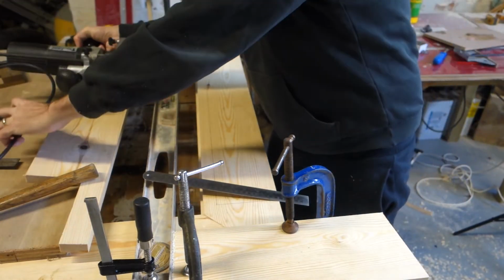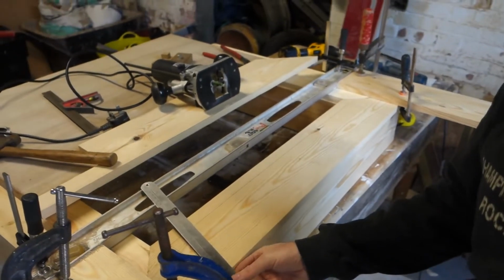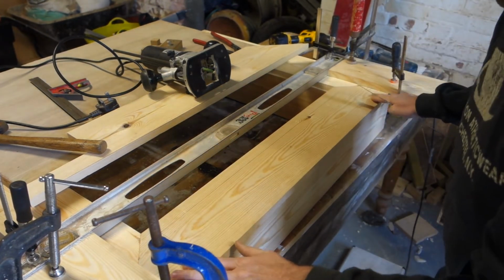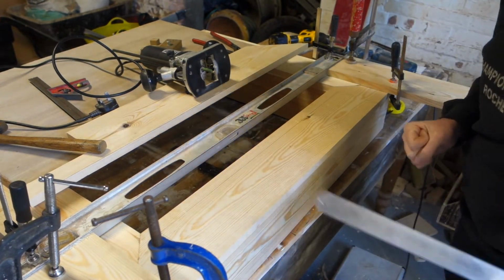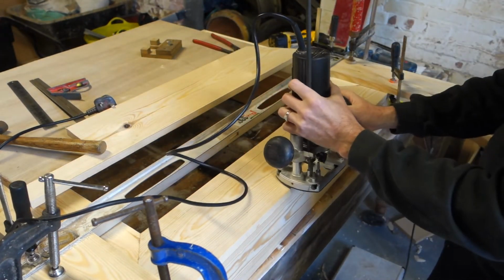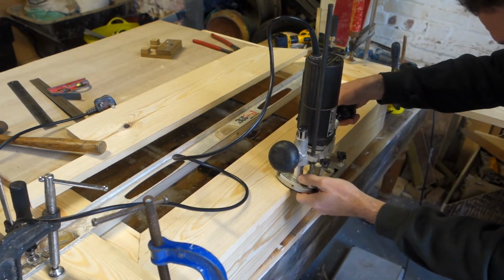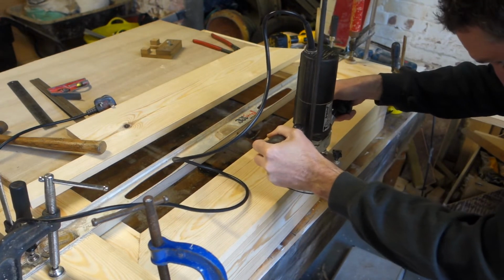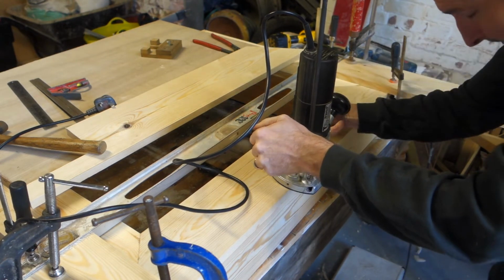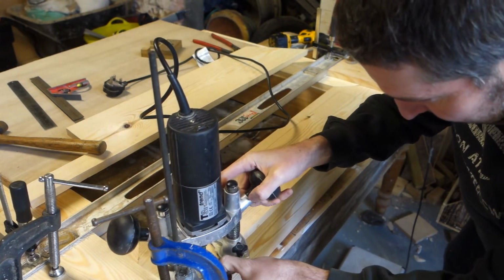Right, so we have now got the whole area trimmed off, or we've got the guide on, so it's a bit rough, but it's still a guide. What you want to do now, before you're doing the cutting, is just check. So undo the thing in the jig, get the router bit just level with the timber, and then just check that you can get your cutter in.